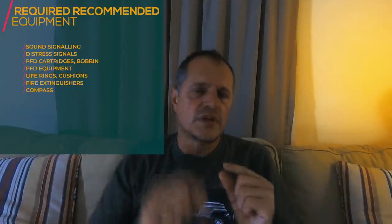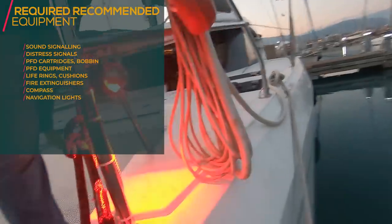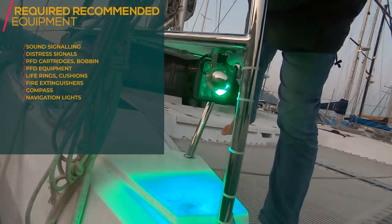Then you go on a southerly route, and because you go south now, you just turn halfway back of the error. And then you go west, and you also go east, depending on which one you did before, and then you also turn the error halfway back. So it means the error on the north and south will both be halfway incorrect. Closest that you can get. Okay.